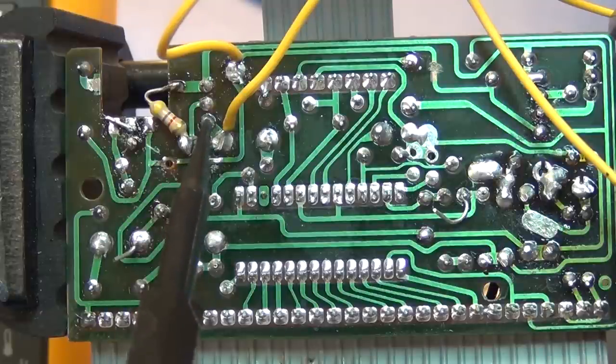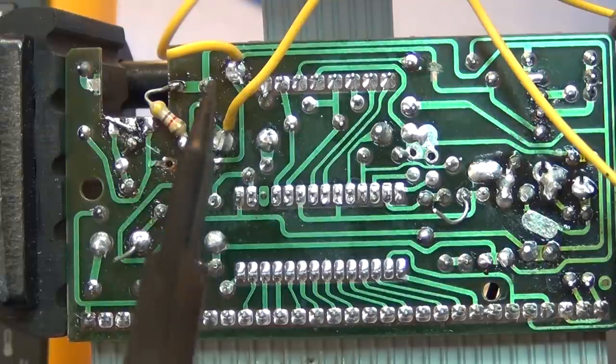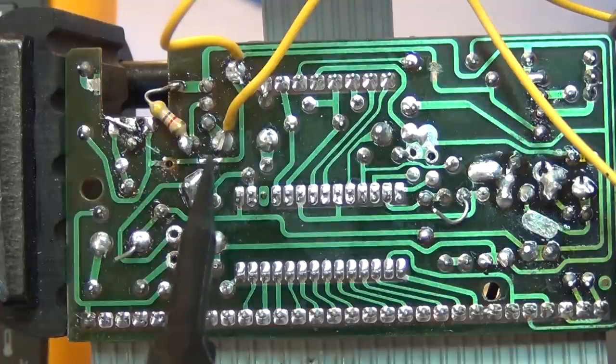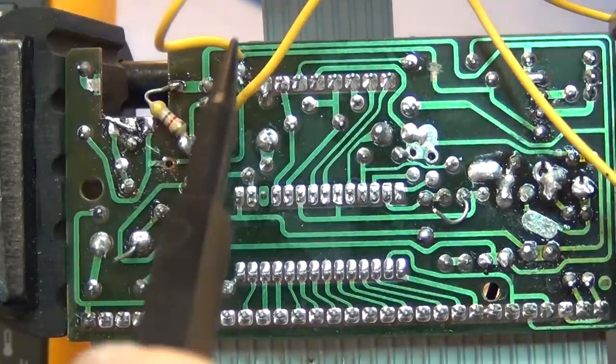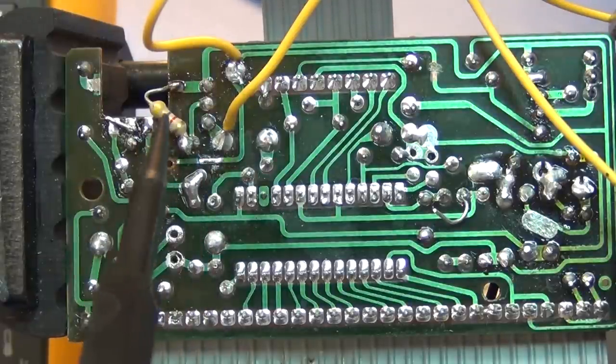So this is the transistor, the collector, base, and emitter. And the clock is going to get power, which I've cut back the solder mask here, and I'm going to solder in a moment. But right now, for testing, we're going to jumper from VCC. This is the VCC pin right here. I'll put a jumper through an adjustable resistor over to the top of the speaker. The speaker will then drive through the transistor to ground as that pulsing signal comes through.